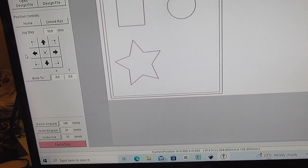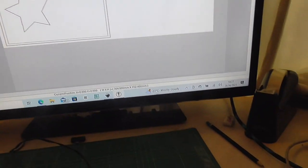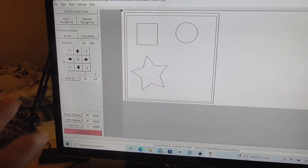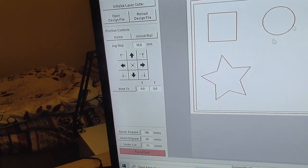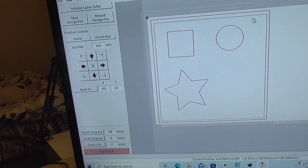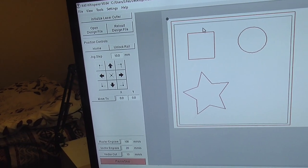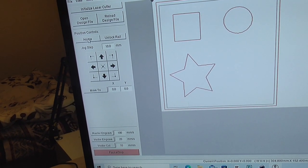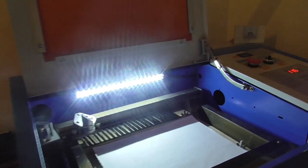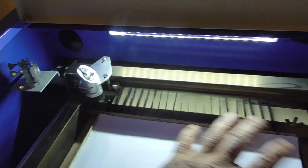Take it back to that point and then go home. That's how the laser is controlled - you purely send it an SVG file. You can move the image area within the print area, but you cannot take it outside the gray area - you must keep it within that area. Because I'm used to doing lasers I tend to leave it there, then push Home so everything is registered. When I built this bed I built it all registered into that corner, and it's quite square in there.